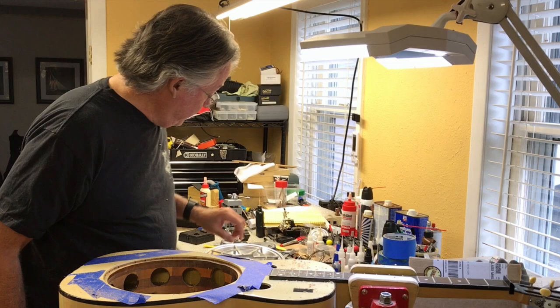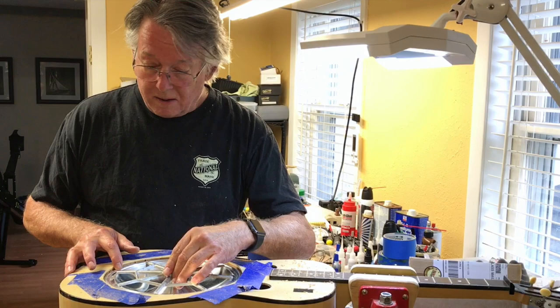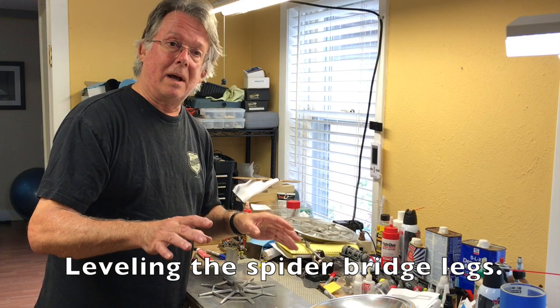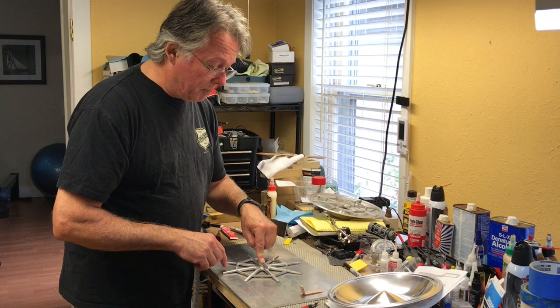This cone was damaged in shipment. I've straightened the rim, so if this worked according to plan, this should drop nicely in like that. For everything to resonate properly and not develop rattles, I've got to make sure this spider is level. I've got a dead flat aluminum platen holding this spider bridge — not with a lot of pressure, just in place.